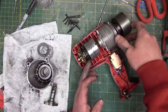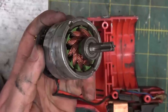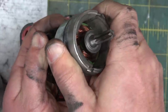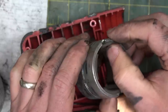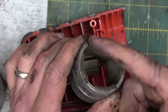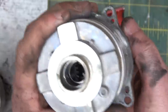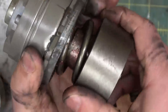Mass times velocity squared — so if we're dropping velocity, we're not getting nearly the torque out of it. I'm going to pull the flux ring off now. And now she's got zero — holy... zero flux left to give. Not much metal stuck in there. So if this were used in a fabrication shop with lots of grinding, you'd see an inordinate amount of schmoo in there. All we're getting is just some rust. Now here we got the planetary gear set speed reduction. The motor would be spinning around 20,000 RPM, but output is 1,600, so there has to be some gear reduction in there.